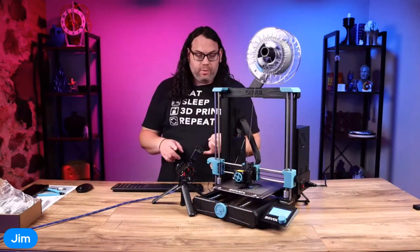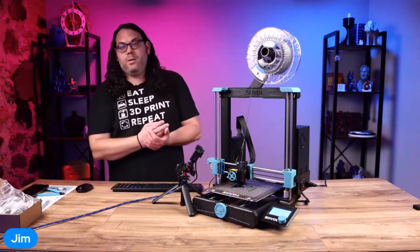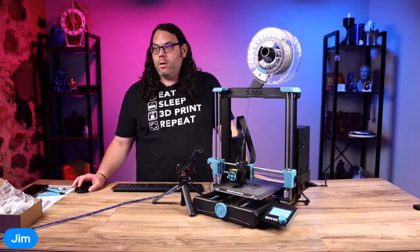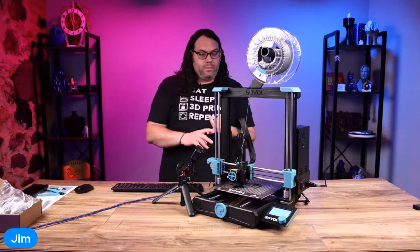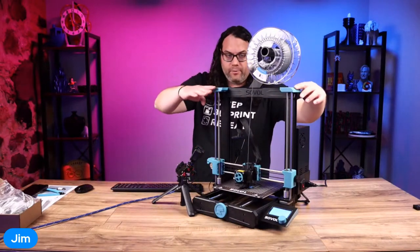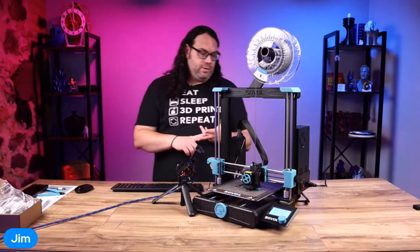It's super easy to assemble. Make sure you put the gantry on forward, stepper motors facing forward, not backward like normal. Super easy to assemble. I'd say 15 minutes tops, if you're not talking like me. It has the inductive leveling, which is great. The Z height adjust that you set. It does the automatic Z or X axis leveling, where it comes up, runs it against the top, and levels everything, which is awesome. Flex plate, direct drive, hardened bimetal steel throat.